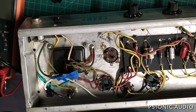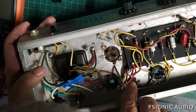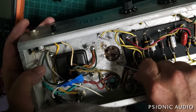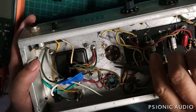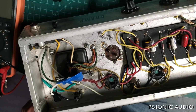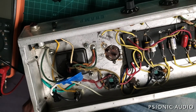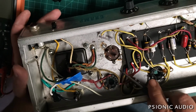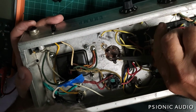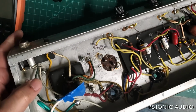So now I just find my little screwdriver, start the bend. Try not to scratch up the chassis as I do this, so just a little bit at a time. Let me get some of that solder a little bit flowier. The solder itself can make a thick spot so it doesn't want to bend back up. Alright. Let's see if this just comes out now.